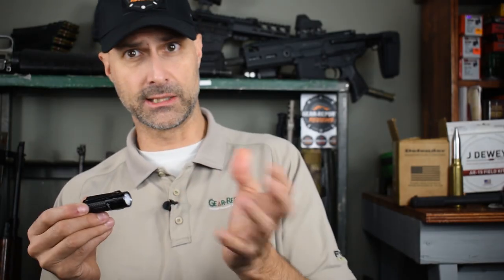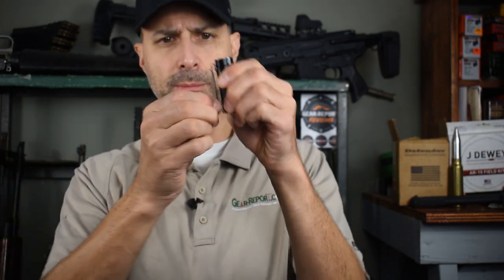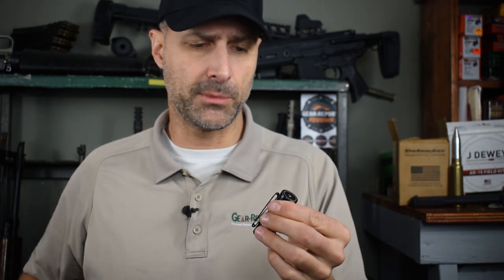Other features — I said it's durable. It has a 6061 T6 aluminum body. Your belt clip works both directions; you can put it in this way or you can go this direction and clip it onto a belt. I like to put it in the top of a pocket right along the lip so that it doesn't get lost down in the bottom. That's a stainless steel clip for corrosion protection. The lens is neat — it's not flat. It's conical but then flat in the very center. That lens shape gives a little different light output — a hotspot in the center that diffuses out gradually beyond there.